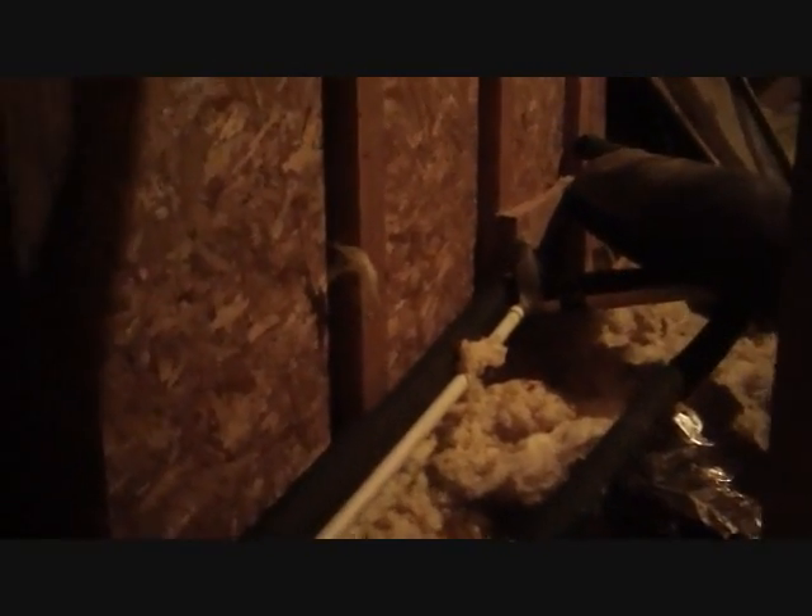I'm gonna run it back and leave it in the area because we haven't set the new unit yet — still have the old Carrier over there. I'll be taking the bender and bending this piece of copper out through the hole, running it along down there with the drain. I'm gonna try to bend it up and curve it around. Once I'm done in here I'll be bending it down the wall and inside the speedy channel.